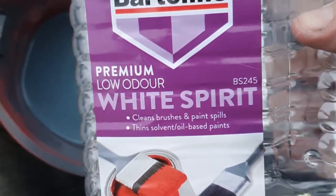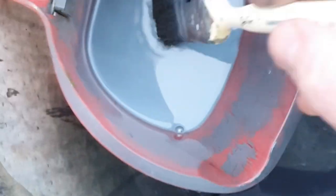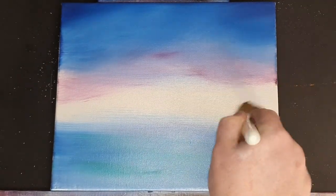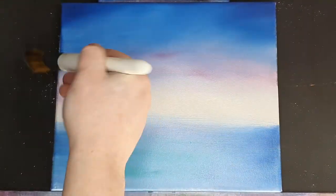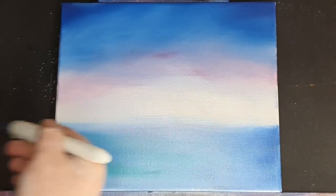Let's clean the brushes now. This is the low-odour white spirit I use. In the bottom of the tub we have got a little rack. What we do is we take our paintbrush and scrub it against the rack — this is dirty paint thinner, by the way. Sweep off the excess, knock it off the brush, and then beat it against that little plastic bar in the bottom of a bucket. Then dry the brush on a paper towel. At the end of the sessions I will wash them out in clean paint thinner. I use odourless paint thinner because it doesn't smell so much, and if you're painting in a kitchen or in your house, you don't want paint fumes.